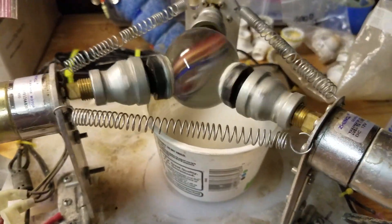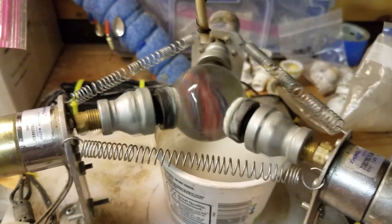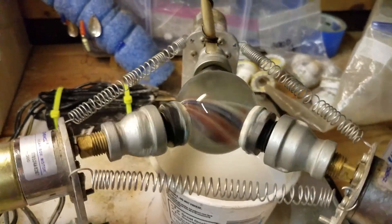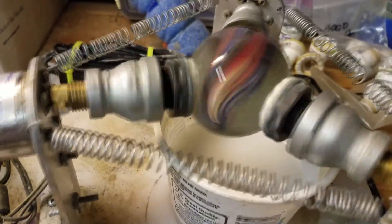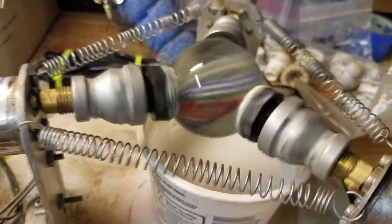I've got some 800 grit cups on there now. We're just going to run it for about 5 minutes on each grit from here on out until we get to the 8,000 grit. We'll probably run the 8,000 for about 20 minutes because that's not going to take anything off — it's just going to give it a super high polish. After the 800 is 1,500, then 3,000, and then we jump up to 8,000 for the final polish. We're really not taking off much material now; we're just taking off the scratches so we can get it polished. Even with just the 800 after a minute or two, you can already see inside it really well, and we have this marble nearly perfectly spherical.